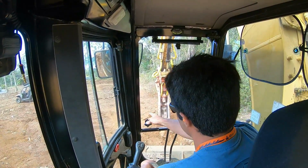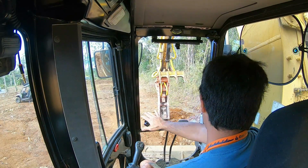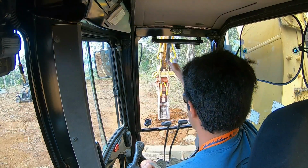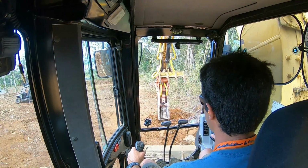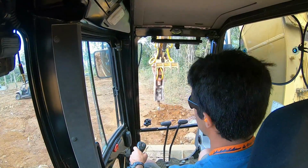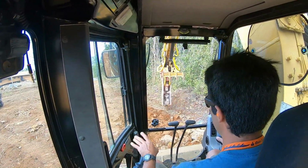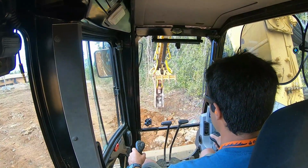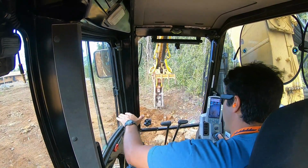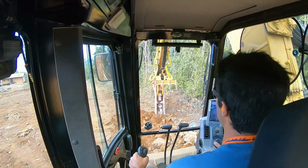This road, so this side's higher and it tapers that way, so all the water drains to the ditch that I'm going to make along the side here and then just shoots out into the little stream there. So I don't want it running onto my property this way, so I've got to take out this high spot on this side, and I'll use this material and pack this side a little higher. I wanted to be able to blend it into the rest of the property, but is what it is, and it's gonna have to be a little bit higher.